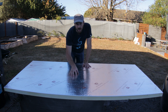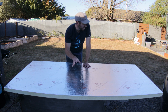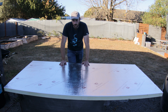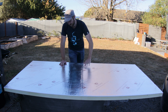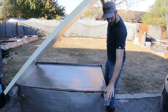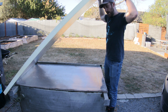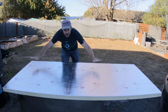I calculated it — this is 50mm PIR board. When this is covering the surface area of this tank we will be venting around 250 watts of heat escaping, which is pretty efficient. If I doubled this to 100mm I think it went down to about 125 watts. It won't actually be that efficient because there's things like this lip and these legs where heat will escape. But our goal is to insulate as much heat in as possible, generated by the steam. The more we can insulate the less energy we need.